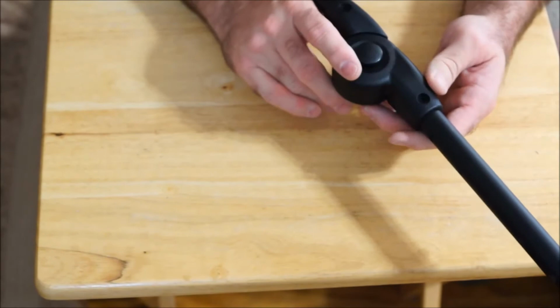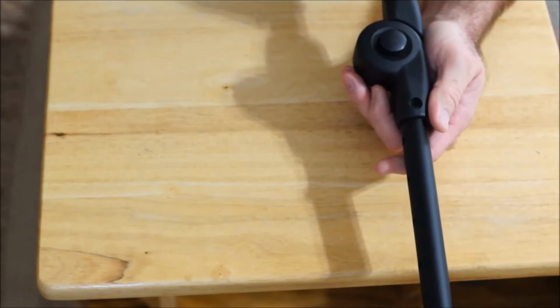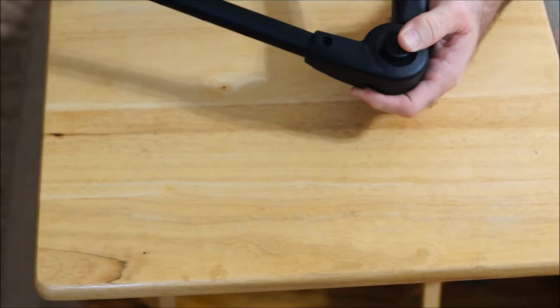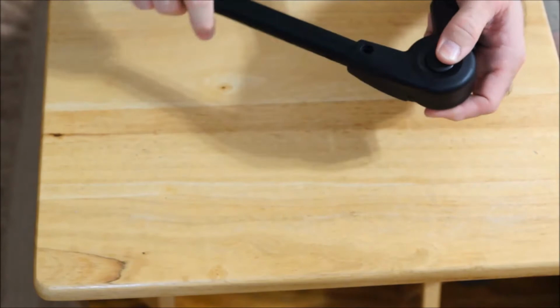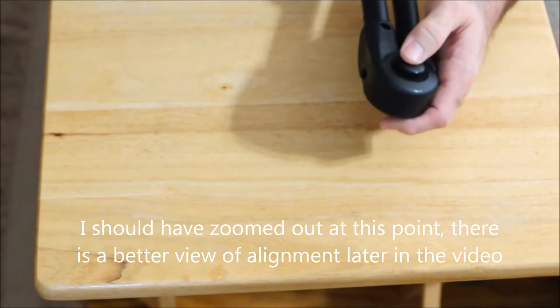And let's say if you were in an operating position, you don't want this unit perfectly 90 degrees to these holes, because then when you rotate this up, your coil and everything would hit your control box. So it needs to be slightly off that 90 degrees, slightly down, so when it rotates up, it'll be like this, and then your control box will sit here, and your coil will sit and rotate over into the arm cuff. So at this point, you've just got your tubes cut, you've got your tubes seated.